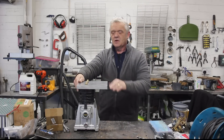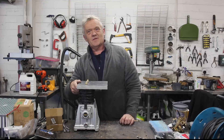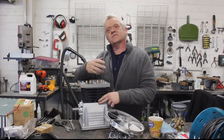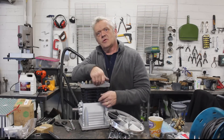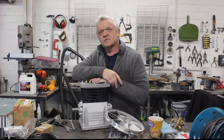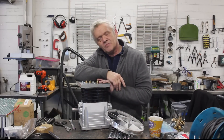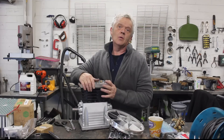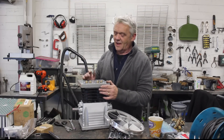Now you notice this big step here, because we've finished with the engine cylinders, but we still need a valve to operate that, and that's going to be where the valve sits. In a steam engine, you quite often have drain cocks at the top and the bottom, because you're putting water in there. When the engine is cold, the steam will condense into water, and those cocks help fire it out. This is considered a bit of an option on quite a lot of smaller models — like the Stuart engines — and if we run this on compressed air, it's certainly optional. I'm going to test it on compressed air before I run on steam, so if I have to put those drain cocks in I will, and if I don't have to, I won't. We'll see how it runs without them, and then if I have to add them, I'll add them.